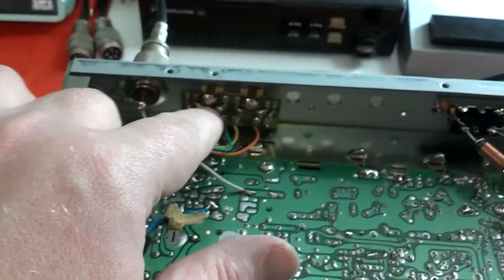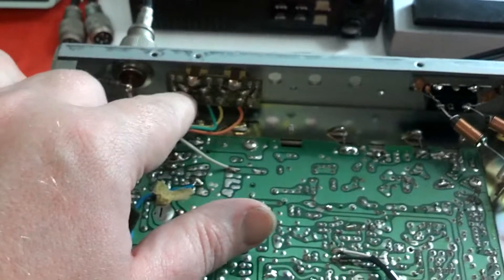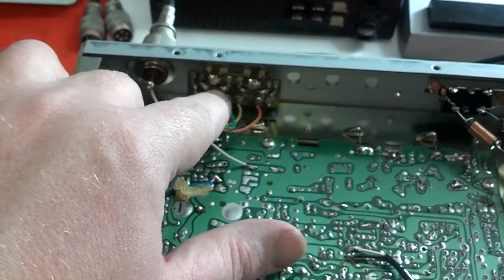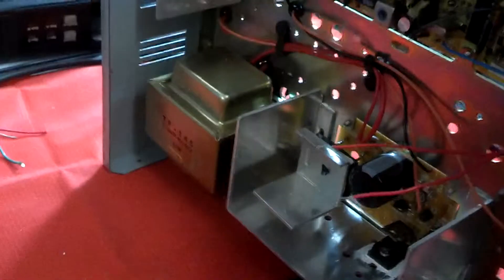So that's fixed — this part is out of the second radio, using some spare parts from that one. I had to re-solder the connector for the antenna and put it all back on. There are no modifications on the PLL, and you can see the meter light is out. I've got the wires here and I'm going to convert that to LED.